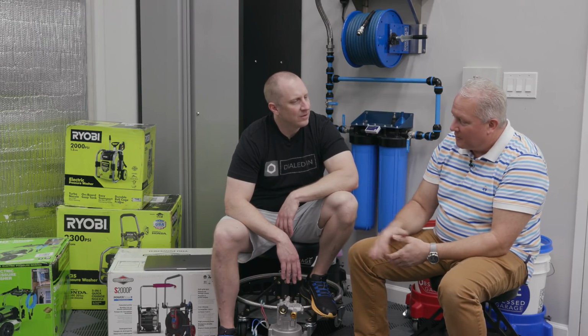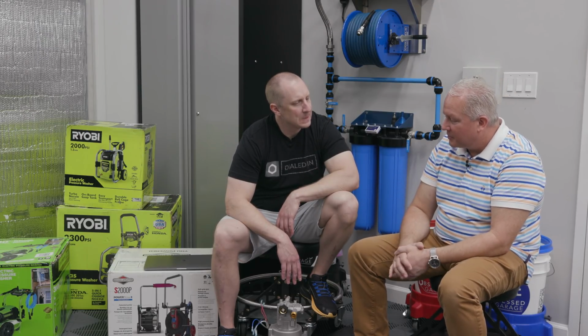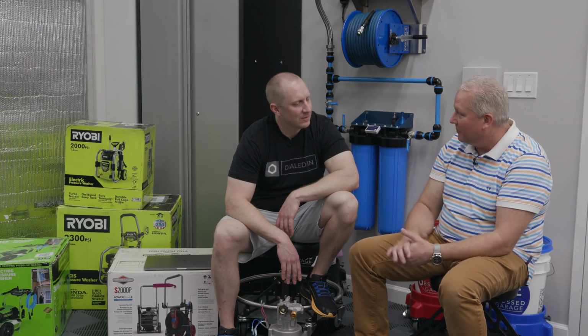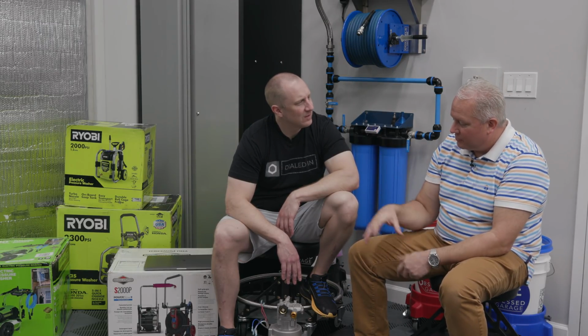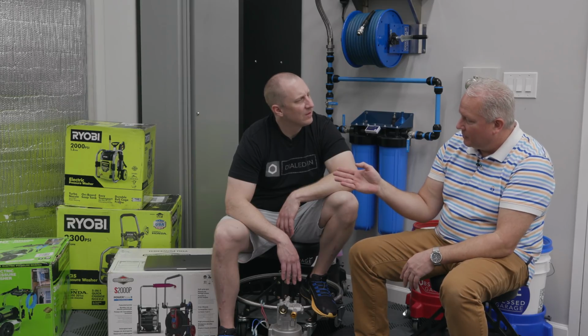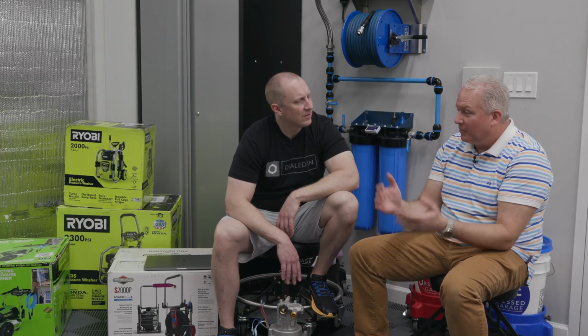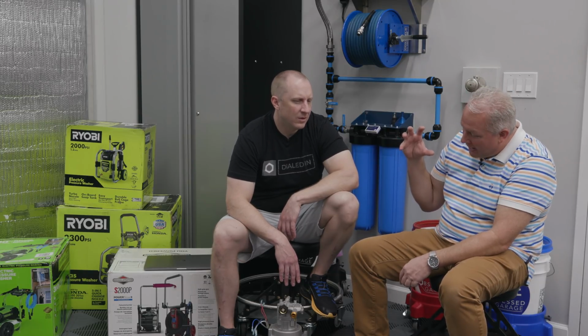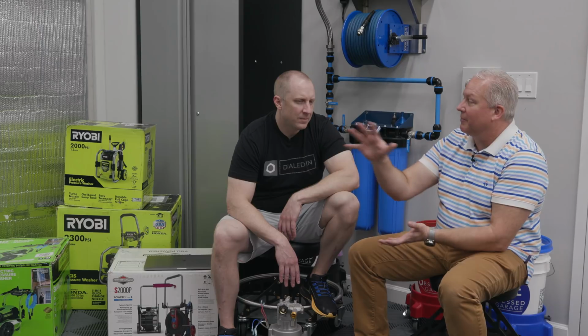So you'll see on most of the electric pressure washers, you're somewhat limited by a 120 volt, 15 amp circuit, right? So you typically are around 1.2 gallons per minute. When you move up into some of the larger gas pressure washers, they'll go up to 4 gallons a minute, right? But it requires a lot more power to be able to drive that much flow at that pressure.